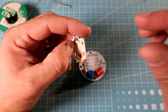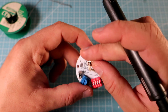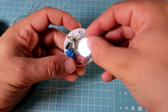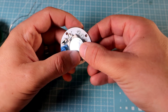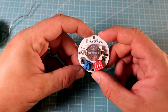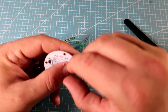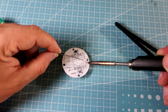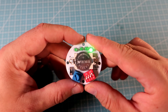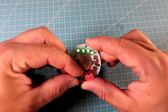Here is a battery holder for a standard 3-volt coin battery — the same battery that is used on motherboards, for example. I will insert one battery. And now it's time to solder the LEDs. I need to use the same color LEDs because different colors can have different forward voltages. Okay, let's test it. It works very nicely — I will try each LED and all of them work great.